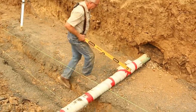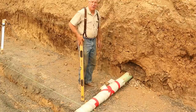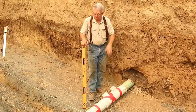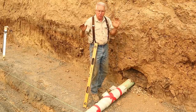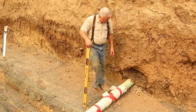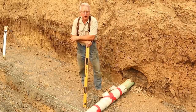When we were digging this last week, Brian hooked this pipe. We didn't know it was in there. It was not on any drawings, not recorded on the escrow documents, and the title search didn't show up anything about easements for a drain line. He stuck a tooth in there and said 'I hooked something.' Now that's a good operator that can feel a pipe when he's pulling out dirt. Sure enough, there's a six-inch perf pipe that was put in here at the time the lots were constructed.